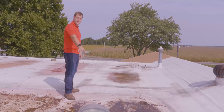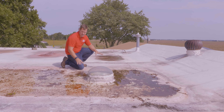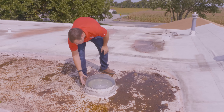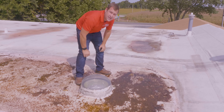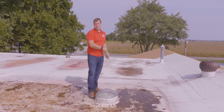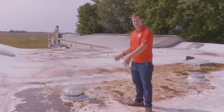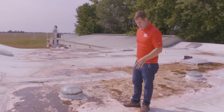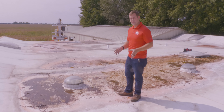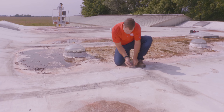The leak area was over here, and it came from just beside this skylight. In the initial inspection, I'm not seeing any holes from the area where it was leaking. The sealant, while a little dirty and obviously on here for a while, looks solid around this skylight, and the skylight doesn't have any obvious cracks or leaks associated with it. Since I didn't find any holes or other obvious issues, I'm going to get a probe and check the seams. I noted the leak was a couple of feet in this direction from the skylight, and looking down here, I can see several patches that have been made to this roof, which means it's probably been a problem area before.